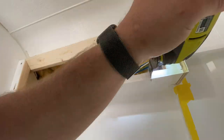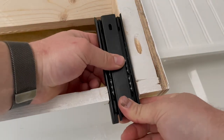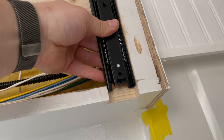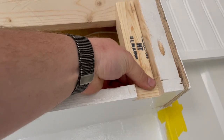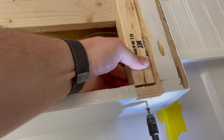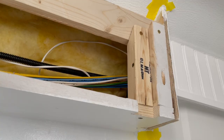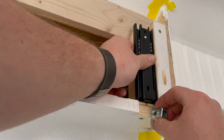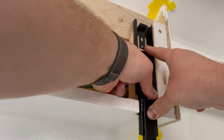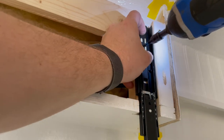I got out the oscillating tool and made short work of cutting out two notches for the drawer slides. Now these slots are in and they fit the hinges pretty well. I just need to get something back here to mount them to, so I cut some two-by-fours down, screwed them into the bottom and sides, and then was able to add the drawer slides, using a little latch as a spacer just to make sure they're both even. I added one screw at the top so I had a little wiggle room in case they weren't completely parallel.